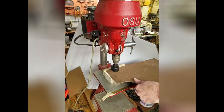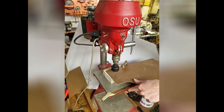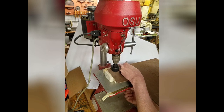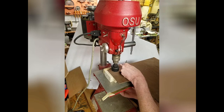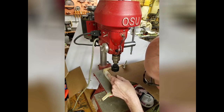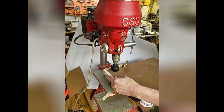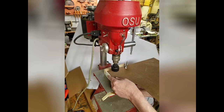Now, let's get started. First we have to cut out the disc. I cut out a 1¾ inch hole from a ⅛ inch piece of hardboard. It's important to use a backing block to get a nice smooth cut. Also, slowly feed the hole saw to keep the cut clean and avoid catching the hardboard.